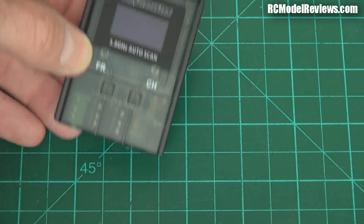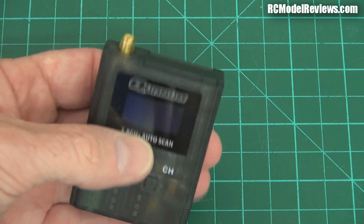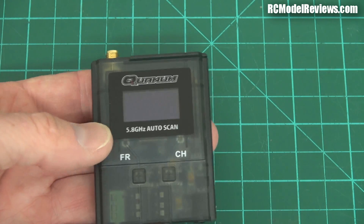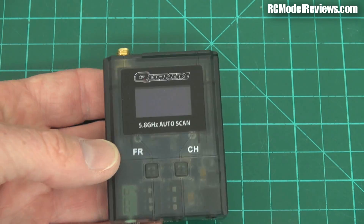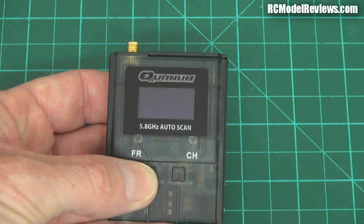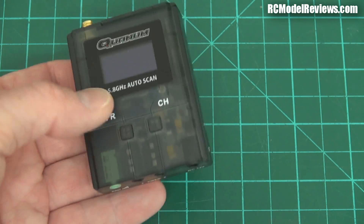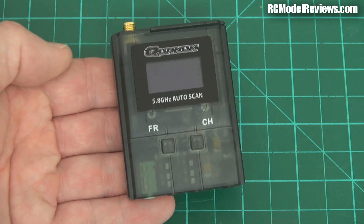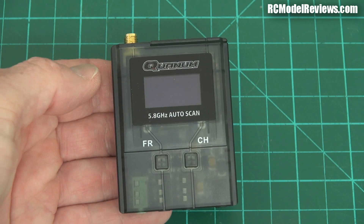It's kind of pretty and it's quite light. Unlike the metal-cased ones, it's quite light and doesn't have a metal case — because it doesn't need to get rid of all that heat that a linear voltage regulator produces, since it's got a switch-mode one. We've got two buttons: one of them is labelled 'Frame' — why do they call it frame? It's the band. And the other one is the channel, so you just cycle through the bands or cycle through the channels.